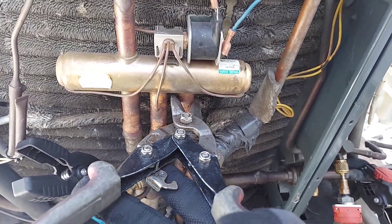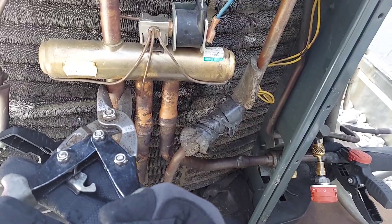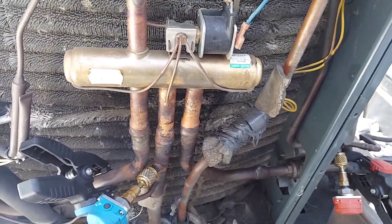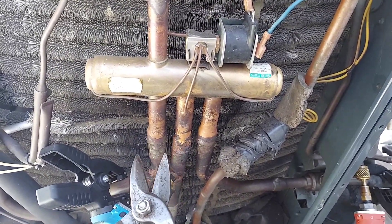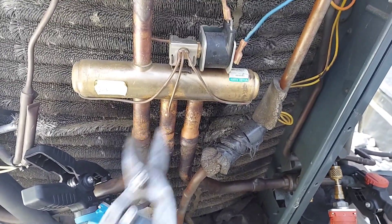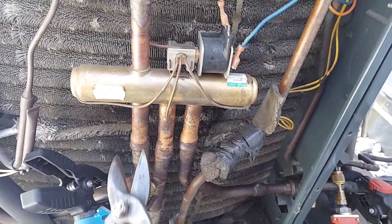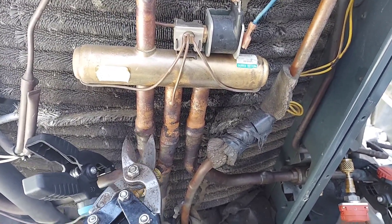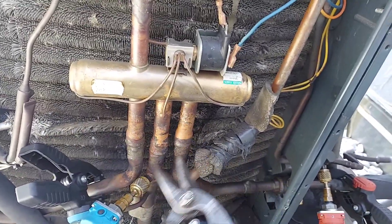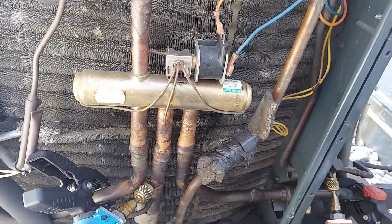Once you do that, you simply take your snips and just cut through this pipe. It's soft enough that it goes right through with the snip. Cut all three, and cut all four if you like. The top pipe is usually easy to remove — just unsweat it and pull it out. The three pipes together at the bottom is the problem. Once they're soft, you just cut through them all with your snips, or if they're already soft copper alloy, just cut all three or four out. Then take your torch and easily unsweat the stub pieces, one by one, nice and clean. Then you can put the new valve in.